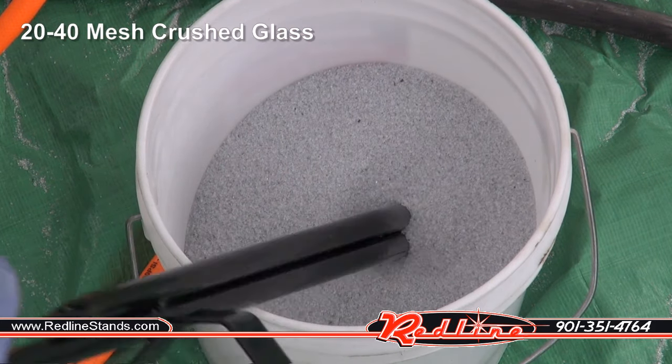And what I realized is happening here is this. Beach sand, of course, from the beach yesterday, has got moisture in it, and you'll notice how there's like a little cavity down in here. I found myself constantly having to shake and stir my sand in order to keep the sand flowing. I believe the reason for that is that there's moisture in the sand. I think if you were going to use beach sand, you would do yourself a favor to just spread it all out over a great big tarp like this. Leave it in the sun for a day, maybe two, and then do your blasting.